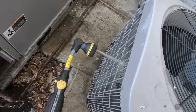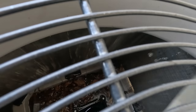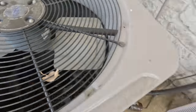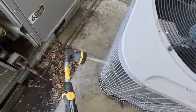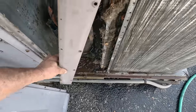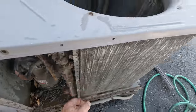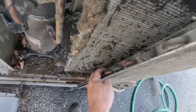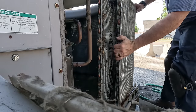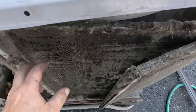I love this wand — it really blasts it in there. You can see the water coming through on the other side. I like to do that until I see perfectly clean water coming through. This thing's dirty. You can tell because the fan cycle switch is shutting off and we're cooling it down that much. We did get that completely cleaned up, which is a whole lot better than what it was. So this is what we're talking about — splitting the coil. This is what most people are too lazy to do.